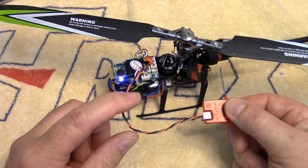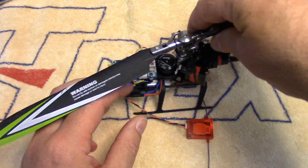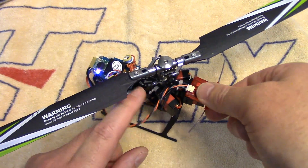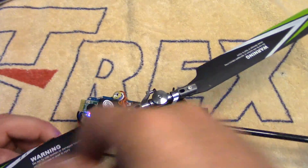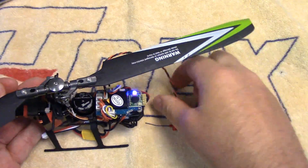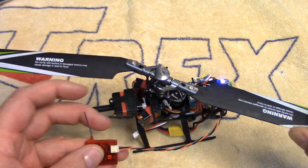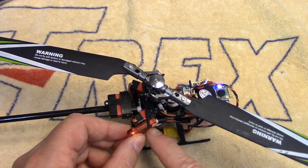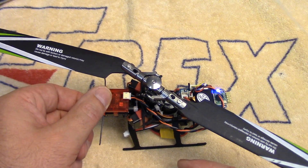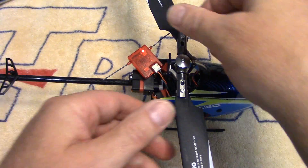As far as mounting the little satellite, I think I would probably mount it up on the back servo here — that would probably be the best spot. Route your wire properly, maybe go on the other side, zip tie it in with all these, scoot it through and bring it up, then double-sided tape it to the top of the elevator servo. You could go on one of the side servos as well, but it's a little more protected up there. In that position I think the CG is still okay, even with the heavy case on. Remember, this heli was a little bit nose heavy.